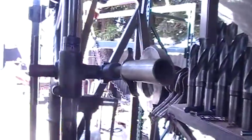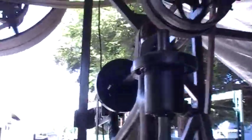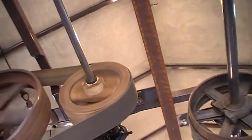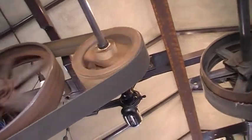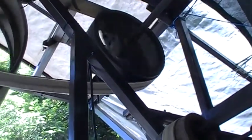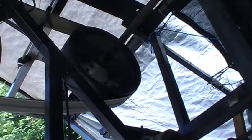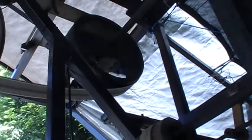But what I was showing here — I got rid of my high-pitched whine, which was very irritating. All it was was that pulley right there, and it was just slipping. Tighten it up a little bit. Now I have it doing what I want. Instead of the pulley slipping on the shafts when I start it up, the belt slips over this pulley, which is a lot better, I think.